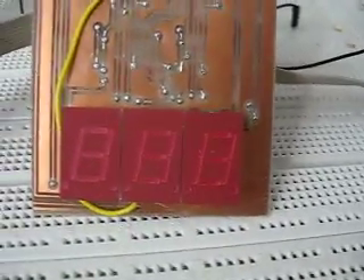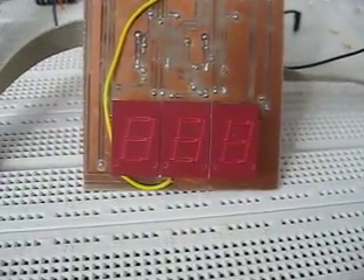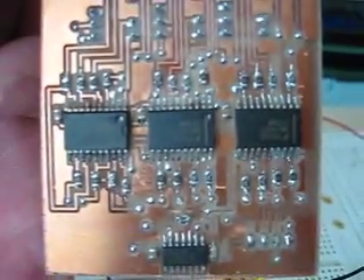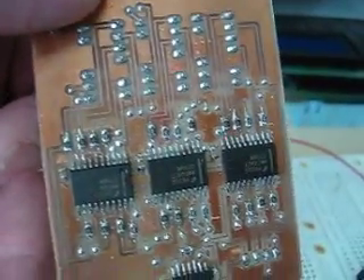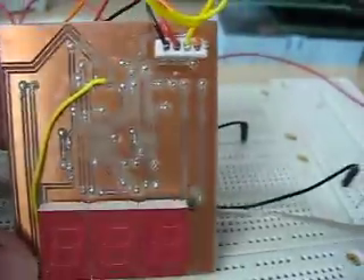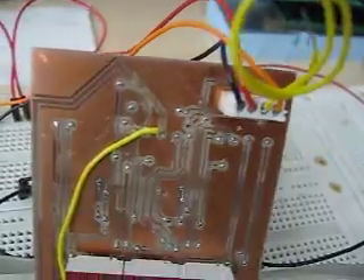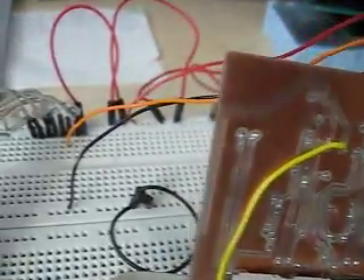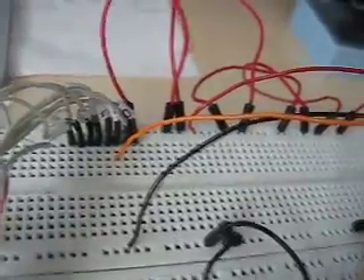This is a project called the one wire seven segment driver, built in SMD. There are three 8-bit shift registers — essentially one big 24-bit shift register. There is the power and ground. Notice the yellow cable — this project could also work as a two-wire setup with data and clock, but it's more interesting with just one wire.